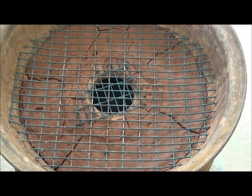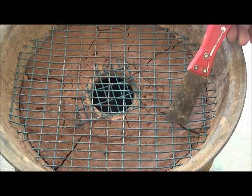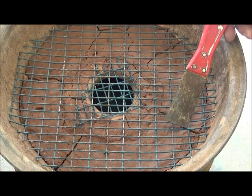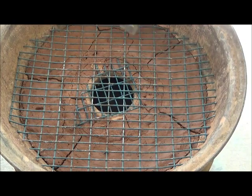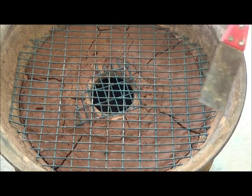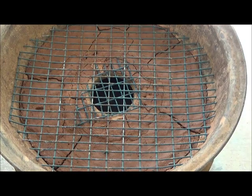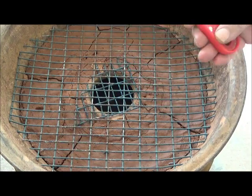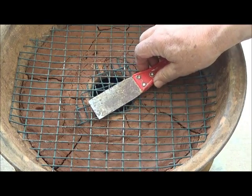Here is a look at our mudded forge. Now as you can see, we are starting to have some rather severe cracks coming through this clay. This one is almost a quarter inch wide. The rest of these are here and here, and are probably growing because this clay is not completely dry. What we are going to do with these large cracks is take this palette knife and make up a mix of another kind of clay.